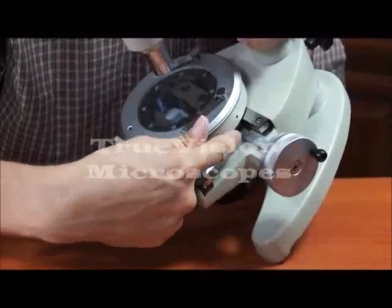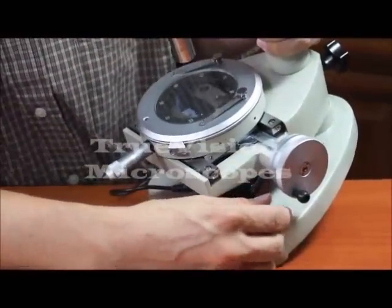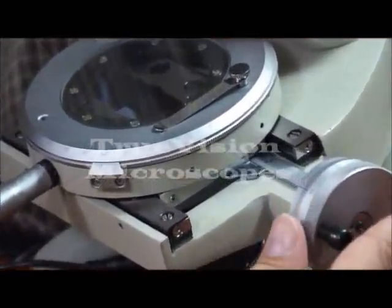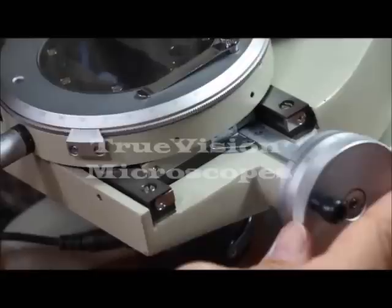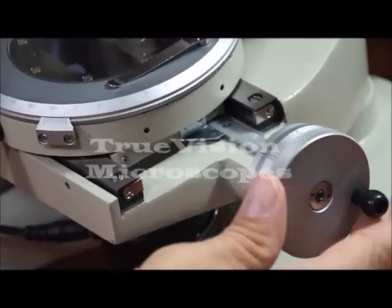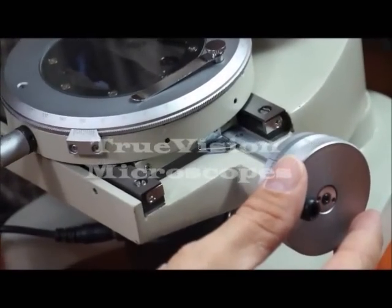Using the scale, it goes from 0 to 50 millimeters. This is your point where you're reading off how far you're traveling. Each increment is one hundredth of a millimeter. Starting at zero: one hundredth, two hundredths, ten hundredths, fifty hundredths which is half a millimeter, seventy-five hundredths which is three quarters of a millimeter, and all the way back to zero again would be one millimeter — that's one millimeter of travel.